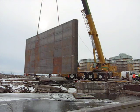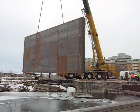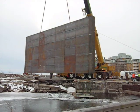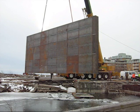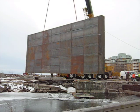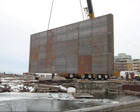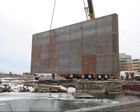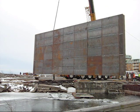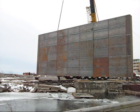All steel, all welded, and then bolted to the structure on three sides are some rubber gaskets, and the thing operates like a fridge door. It touches on three sides, and the pressure of water will be enough, we hope, to make the main seal, and there may be a couple of things we don't know about, cracks in the abutments, but we'll see that when the water gets pumped down.